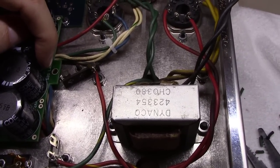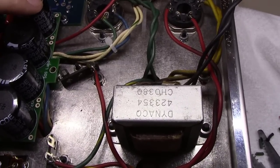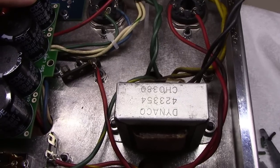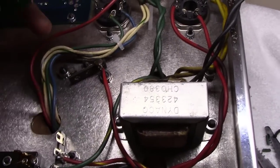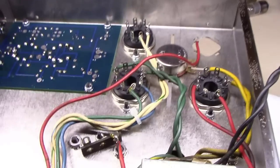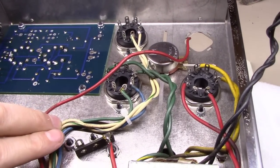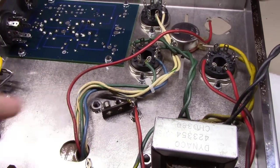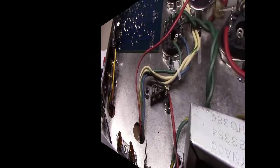I need something that comes up a little bit taller right here so that I can put a little bit of standoff. I need to put a bolt underneath it to stand it off a little bit, and then I need to be able to put a bolt on top of it like this so that I'm not squishing down into these wires, because there's high voltage sitting on these little things. So I need something half inch, maybe not quite. I may need 3/4 inch right here for these two screws. So I'm going to go over here and see if I can find some.